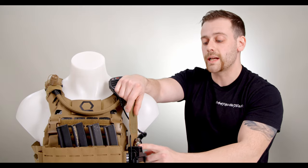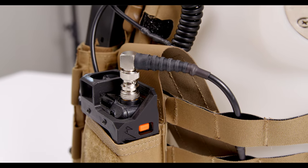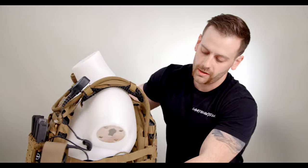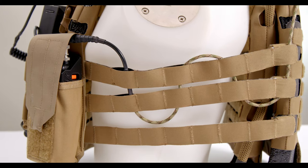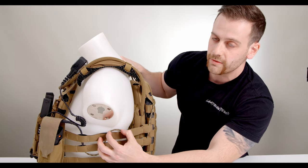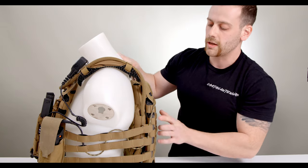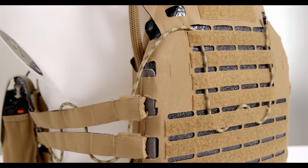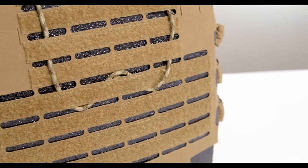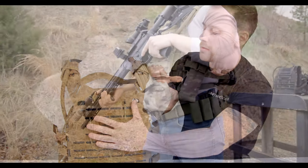The antenna setup on here is my 90-degree variant of the Baofeng package. So it's going to include one of the Baofeng adapters and a 90-degree mounted antenna that's BNC. And when we route it, since it's 90-degree, we're utilizing, just like on the relocation cable, the cummerbund. But we're ensuring to give it good spacing here, because this antenna, the colored 550 portion, is what's actually propagating the signal. So we're making sure that goes through, it comes up. And like we said before, that EXO has these great, nice little cuts in it. And we're routing it in a U-type shape. If you can't do a U, try to do a straight. If you can do a U, that from the testing I've done propagates the best.